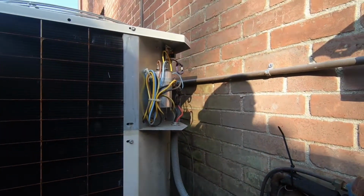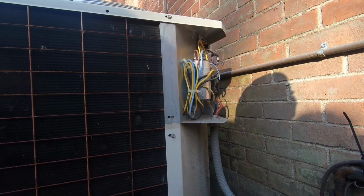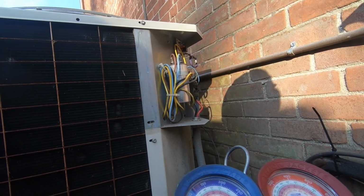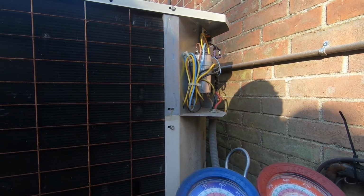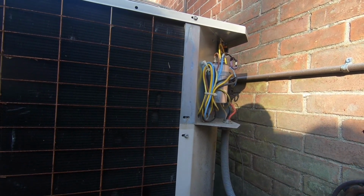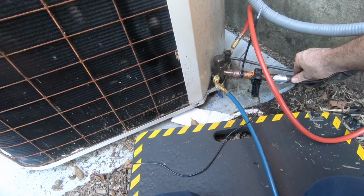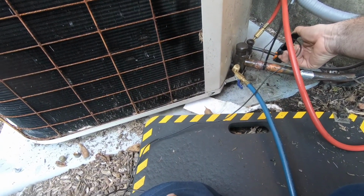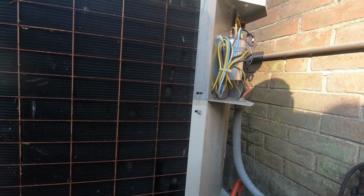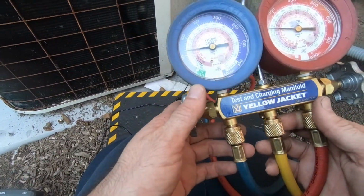Okay, so I got tied up on the phone, making several phone calls. Right now we have a 48 degree suction pipe. And according to my gauge, we are 34, so that's giving me 14 degrees of superheat. I'm perfectly fine with the way the system is operating. My subcool, according to the door, 20 degrees, which is huge. Very big subcool. I have 205 head pressure.